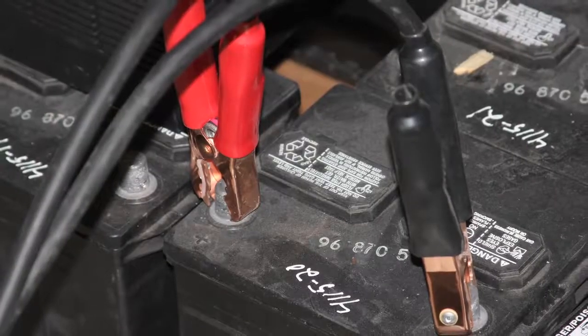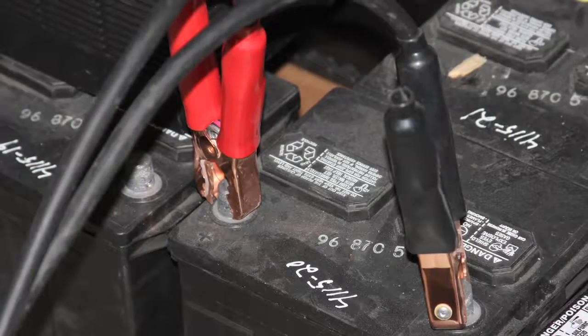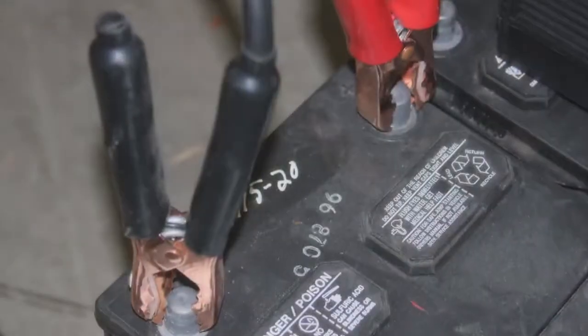Some locations charge batteries overnight, a full day, to be able to test them. This way, with a diagnostic charger, you don't waste time charging batteries that end up being replaced. So instead of having these 6 different processes, and waiting possibly 6 hours to a day and a half to get that answer, a typical recovery cycle is in less than 20 minutes.